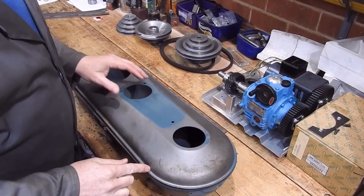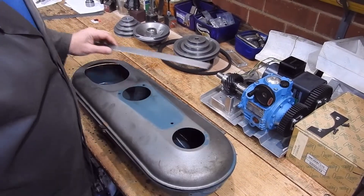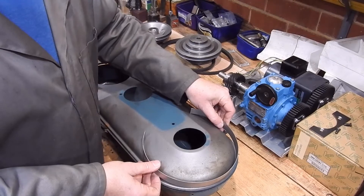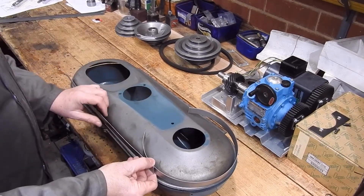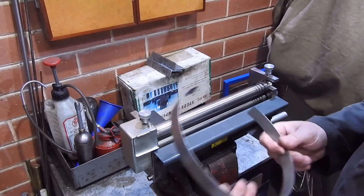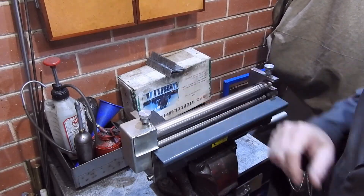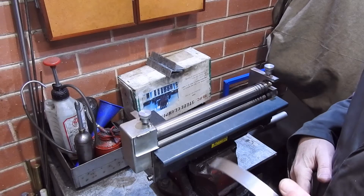To match the end radii of the guard I've cut several strips the width I think I need, propped up 20mm, and run them through my little hand rollers to get a curve. This is more than I need but the rollers tend to flatten out the ends anyway, so I'm going to trim this to suit - it's around about the right radii and that will enable me to cut that join, add a straight piece on, and continue around so I can pop everything up 20mm. These are my sheet metal rolls, not terribly complicated, around about 300mm, and they can produce a cylindrical part. By adjusting the back and a little bit of wiggling you can also produce a conic section, so they're not a must-have but they're certainly a useful tool if you're going to be doing round section sheet metal work.